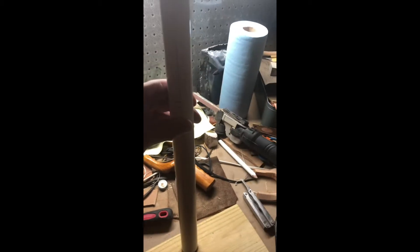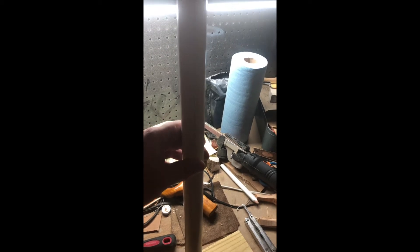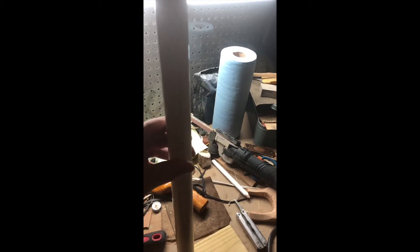I need to explain myself here. I put a little block of wood inside the PVC. I measured how far that block of wood needed to go to be center on this. What that does is keep this from pinching closed when I heat it up. I don't know if a lot of people explain that, but I figured that was pretty darn important. If you didn't do that, you could flatten the whole thing and it would be all out of whack. Then I'm hammering it in there because I made it really tight.